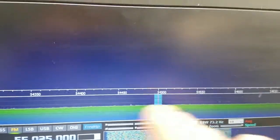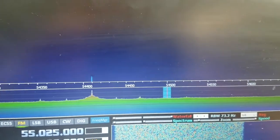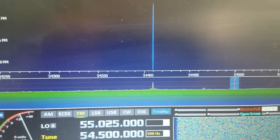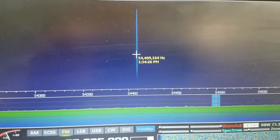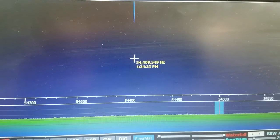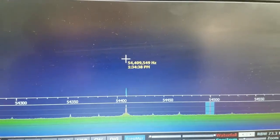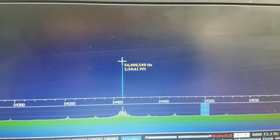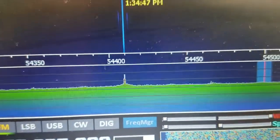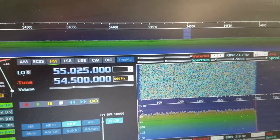So I'm at about 54 here, looking for — oh, there we go — I'm looking for a second harmonic. There's the second harmonic. Remember we're on channel 20, so that would be 27.205 MHz, and there's our harmonic at 54 — it should be like 54.41 and we're at 54.490 for that second harmonic. I am modulating it if you look down here. The radio is not too bad.